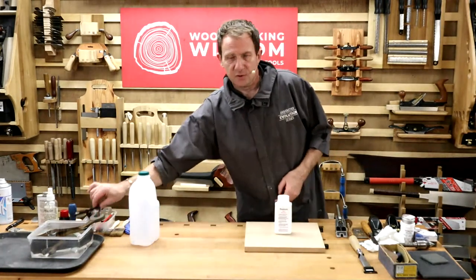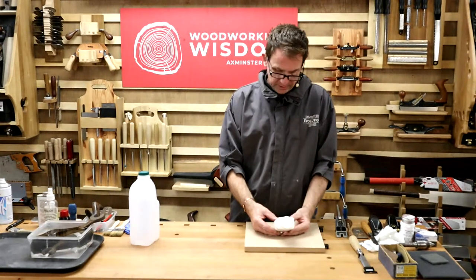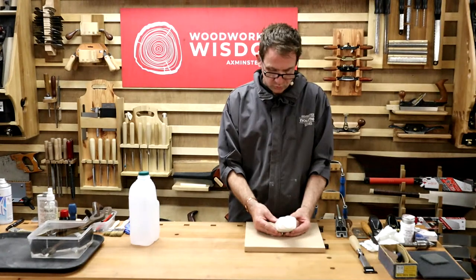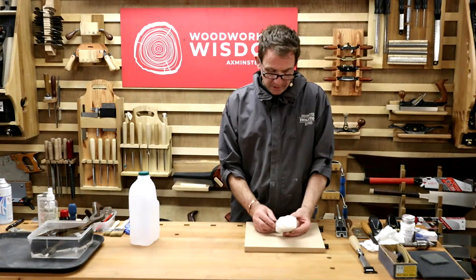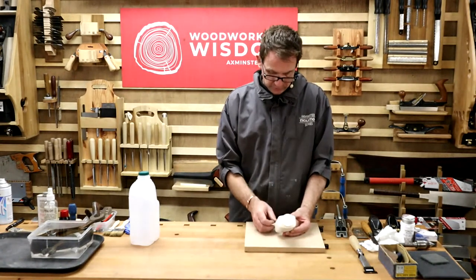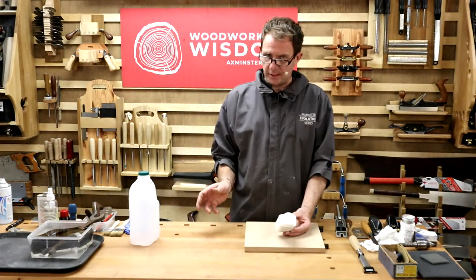I'm using this stuff. I haven't used this before, so it's a bit of a play for me. It gets really good reviews on the website. So, interesting for me, it is a restore rust remover. It restores steel and iron tools and components. It's non-acidic. It will only remove the rust, harmless to plastics, rubber, non-ferrous metals, and timber. But I took the knobs off because I don't want those in there. It will de-rust items and then protect against further corrosion, which I find amazing because you dilute it with water.